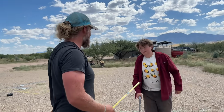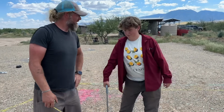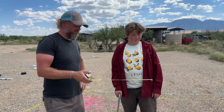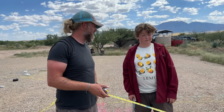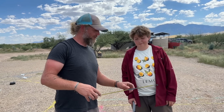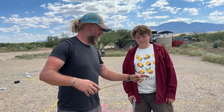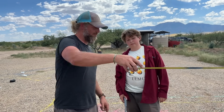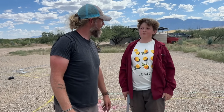All right. You are not old enough to be limping around. Okay, listen. We're doing a 4-inch pipe trench, which means we need to dig it at least a foot wide so that we can get around and work on it. So I'm gonna put my 6-inch mark right in the middle of the blue line. You need to hit right here and at a foot. And then you're gonna mark that distance on each side and we'll just keep marking them as we go down. Dots. Dots are good.